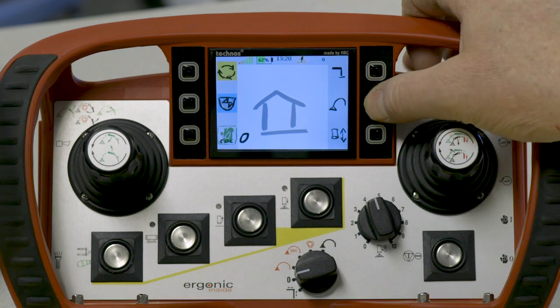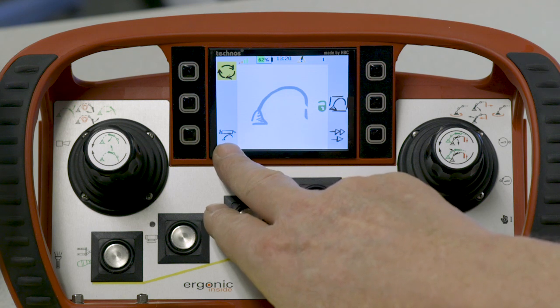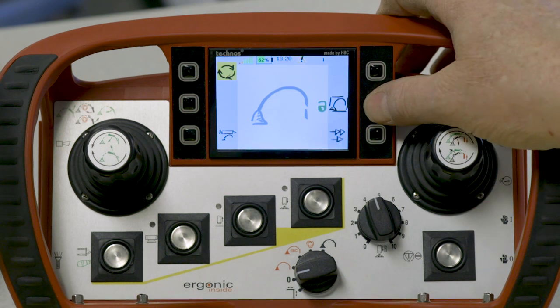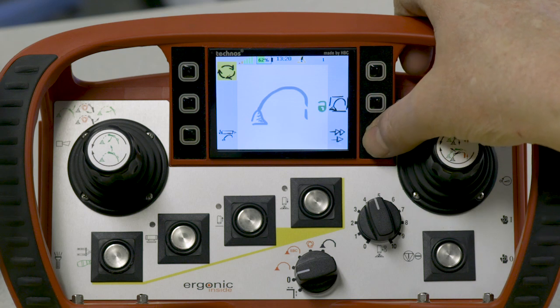The boom icon — if I push the boom icon, you'll see the screen light up with a picture of the boom. Here we can access the cylinder icon in the lower left. If the customer has purchased an auto lube system, here he can do a manual cycle of his auto lube. All auto lubes — hopper and boom — work automatically, but sometimes we want a little bit more grease. So the operator has the ability to select the auto lube and add more grease or do a manual grease. We also have an icon for setting boom limits and an icon for his rabbit and snail switch.